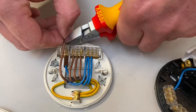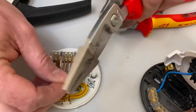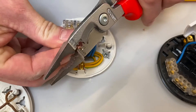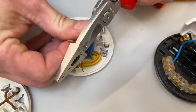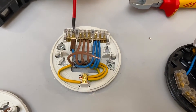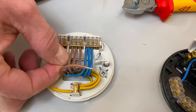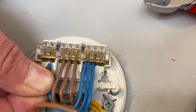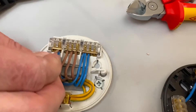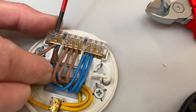In order that these two come on together, strip that one back. I'll use my five-in-one tool - we can go into that hole there. Not quite enough, so just a little bit further - you can see how precise I can be with these - in order to expose my copper. We're going in there to share our switching line connection. You might just want to check it for fracture, see how bad it is - it looks all right to me, just a slight squash in it. Then we pop our cable in to share our switching line connection, and tighten those up.